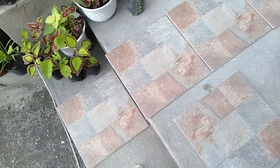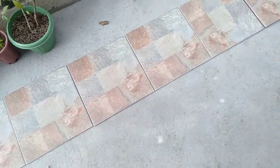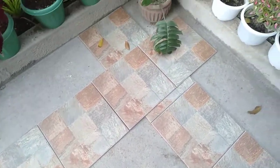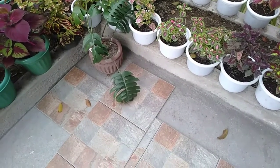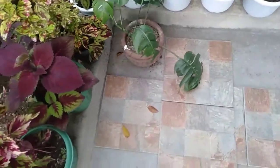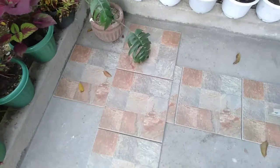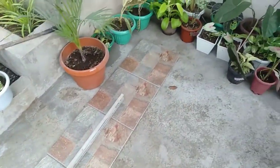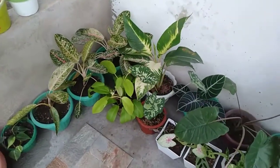Now, I've laid out 8 tiles up to the point where there's a cut. Just laid them out with approximately 3 mil gap. I've done the same the other way, laying them out there's approximately 10 tiles. I've laid out 1, 2, 3, 4, 5, 6, 7, 8, 9 will be under the plants, plus 1/2, or just under 1/2